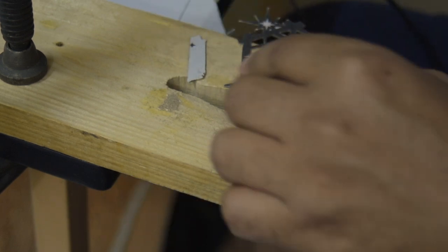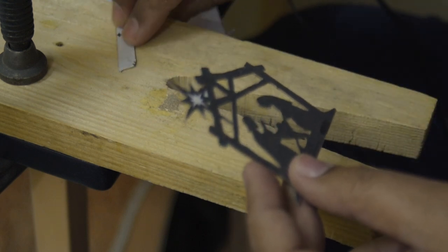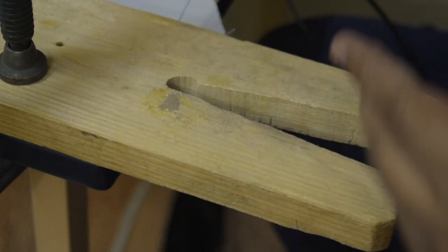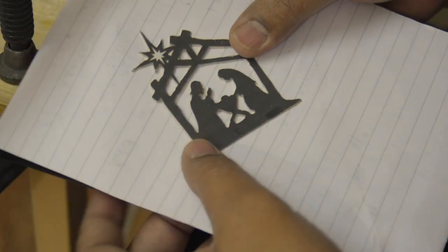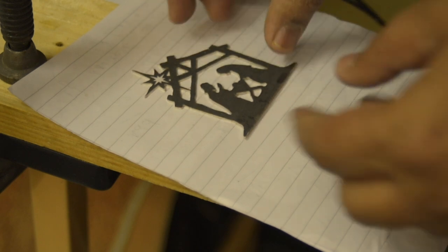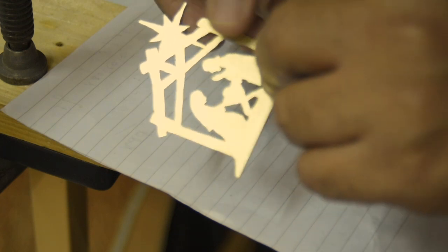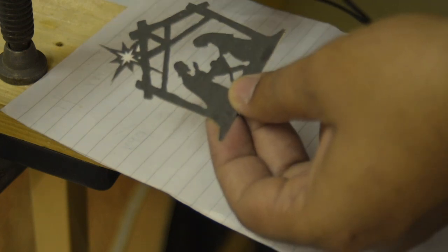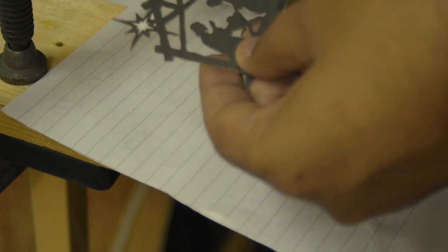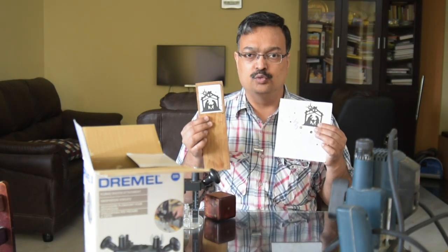Now I have completed the cut of the brass — you can see all these pieces that have been cut off, and this is the image clearly visible. This is the piece which now will be put inside the groove that I will make in the wood piece. If you see the other side, you can see this is the brass piece with the mirror image, and this has the paper stuck to it. Once I have embedded this and done the sanding, the paper will be gone. Now I have cut my brass piece and I am ready to cut the wood piece — that is, cutting the groove inside the wood.